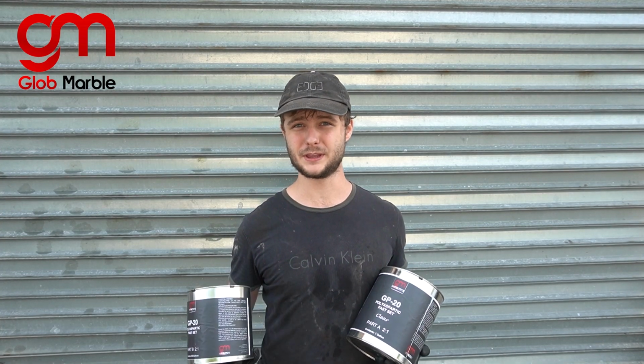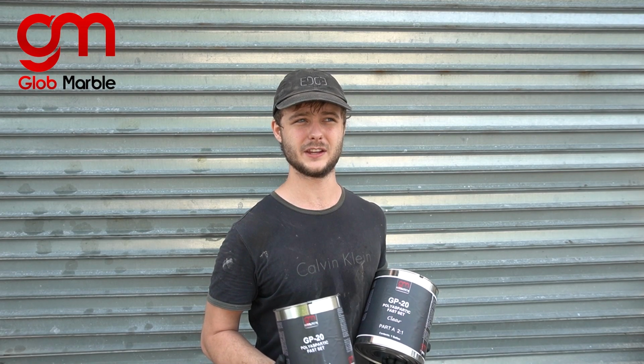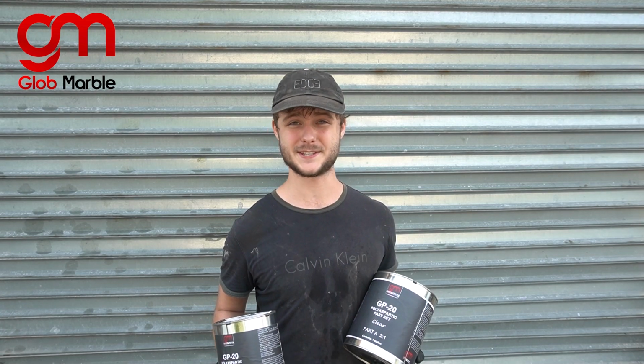Basically what you do is you pigment the first layer of polyaspartic and you lay it onto the floor, throw your flakes. Yesterday I was actually able to come back from a sample and lay the second coat of polyaspartic 1 hour after the first one. But granted, it's summer right now, so the heat does make the polyaspartic set a lot quicker. It might be around 2 to 3 hours in the winter, but I don't know because I haven't tested that.